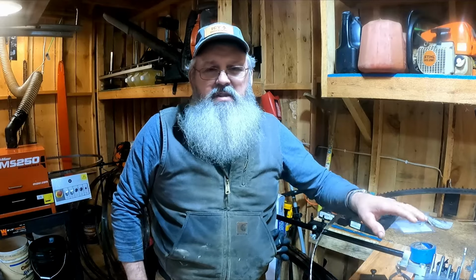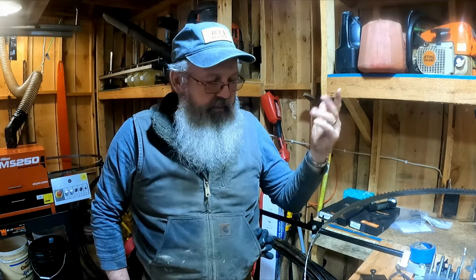Okay guys, I finished setting that. I didn't put a mark on there because I've done enough of these. A 158 inch blade is 60 pulls to go all the way around.